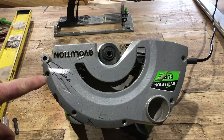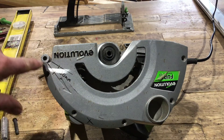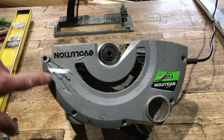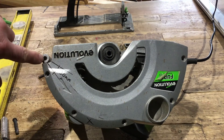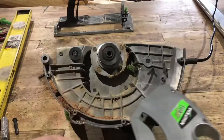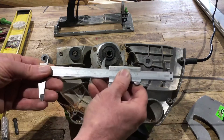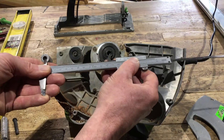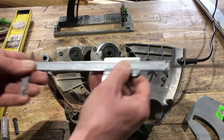I've drawn two lines with 30mm measurements and marked a little cross from the centre of the hole. By measuring 30mm and 30mm I'll be able to find the exact centre of this hole, so I can take this piece inside for my drawing. And I've measured the centre of this hole to the centre of this hole — it's exactly 115mm.